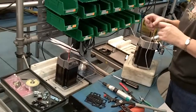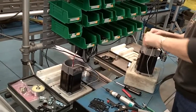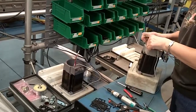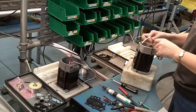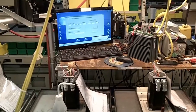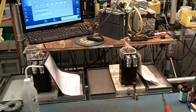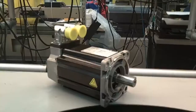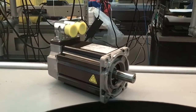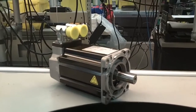Trays move down the line one at a time. Components are assembled to the motor and then moved down the same line to begin their functional tests. At the test station, encoders are aligned, inductance and resistance is confirmed, and the motor is spun at rated speeds to confirm that it is operating to specification. Upon successful completion of its functional test, the motor receives final preparation and is ready to ship.